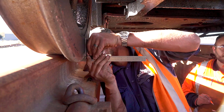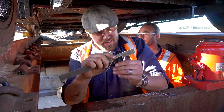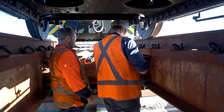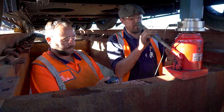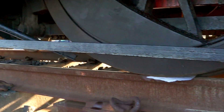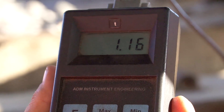Back of the flange to derail — probably got there 50, 57. Hydraulics, a load metre and patience are needed. We've got to make sure that we zero it without any load on it, so that's telling us the truth. Lifting each wheel off the track by just the thickness of paper is enough. So that is 1.16 tonnes already.